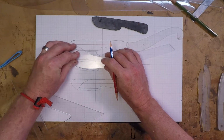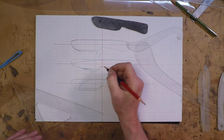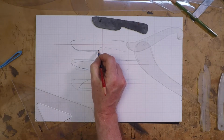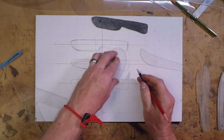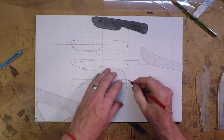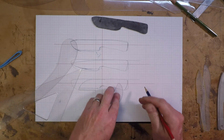And I'll make a straight line for the cutting edge on that knife, but you'll see I'm going to blend it in. I don't really like straight lines except just the very cutting edge. I like every other bit of the knife to have a curve, and usually a few different curves with different radiuses I think look great together. You can see I'm using lots of the different pieces from the ship's curve set.